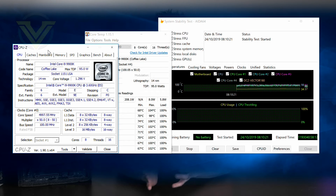In terms of performance, this board is in line with other rival Z390s, which is a great thing. It offers solid performance across a range of different tests, and a full website review featuring all the benchmarks will be available — the link will be on screen and in the description. We were also able to hit a 5GHz overclock on the 9900K at around 1.32 volts. It wasn't as straightforward as some other boards and some advanced settings needed to be adjusted, but that is a good result nonetheless.